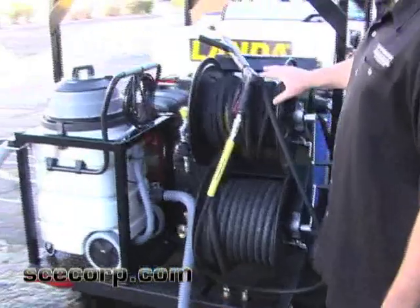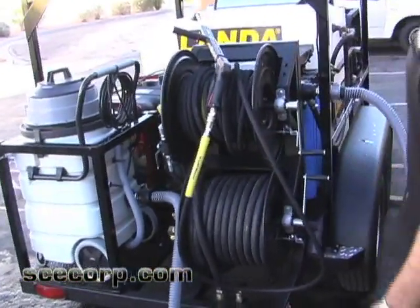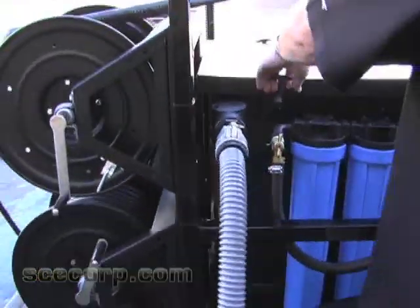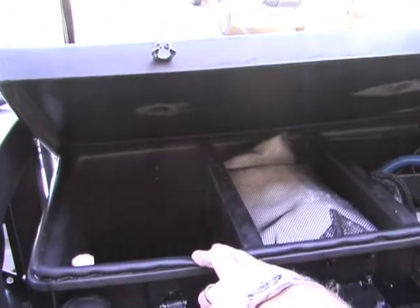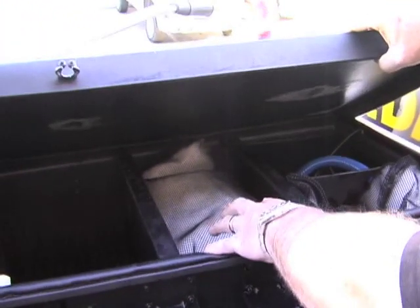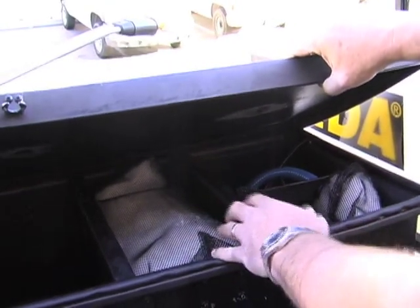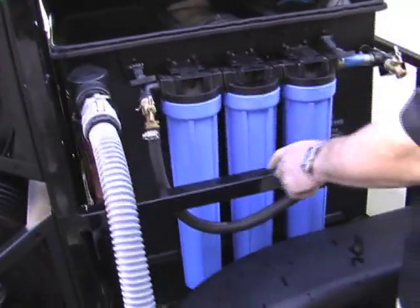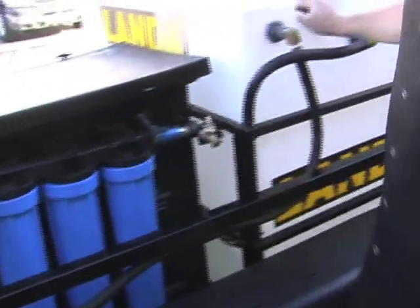Back here we've got two hose reels — one high pressure with 100 feet on it, and one with 100 feet of water hose with stacked reels. When water comes into this system from the vacuum boom, it runs into the onboard portable water filtration system, where it goes through a series of coalescing grids to remove oils. There are foam filters and sock filters to take out solids, and then it runs through 100, 50, and 10 micron filters.